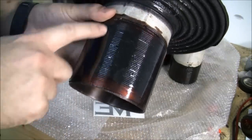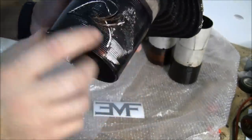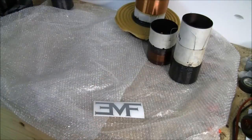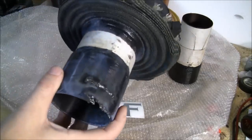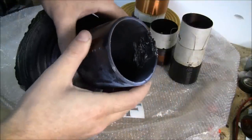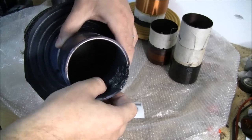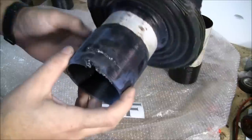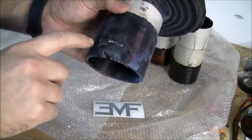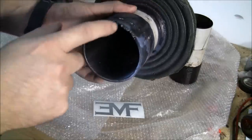There are other signs of excessive heat, and clipping generates a lot of heat but also blows holes in the wire. We've got another example — the previous one was a Korean amp, this one is a Brazilian amp. You can see a big hole in the former; it completely melted the former right onto the pole. We had to knock it off. When you have a Brazilian amp with any amount of clipping, it goes really wrong really fast — holes blown all the way through it, all this damage.